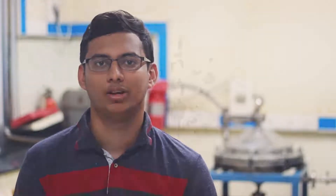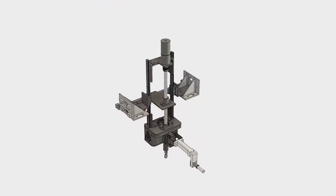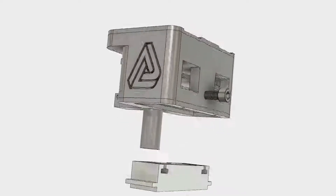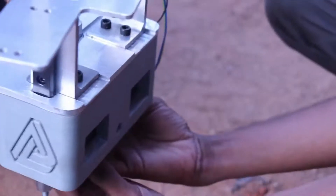Our science plan focuses on evaluating the collected soil sample for indications of supporting microbial life. To achieve this, we have developed a digger which uses a lead-screw mechanism to produce coupled linear and rotary motions of the drill bit. A 3D-printed cache container is located surrounding the drill bit in such a fashion that it is automatically sealed on removal from the digger, so as to prevent contamination of the collected sample.